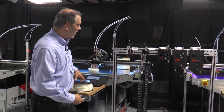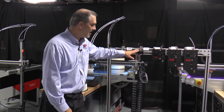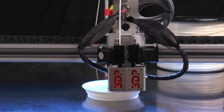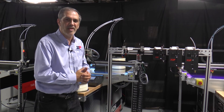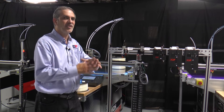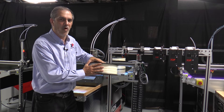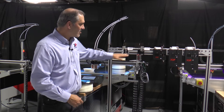Now, we also have available the HFAs — high-flow air-cooled extruders. These come standard on the 300 series and they're a very good extruder for higher flow, higher volume throughput. They come with 0.4 to 2.5 millimeter nozzles and can do up to about 7.7 inches cubed per hour. To put that in perspective, you can double your throughput — you're talking two of these 2.2 kilo or five pound rolls in that same day time frame.